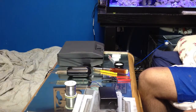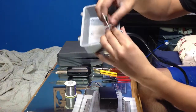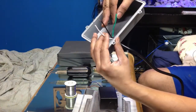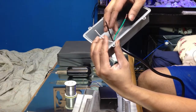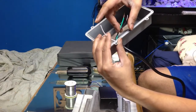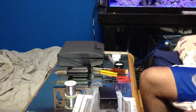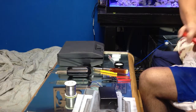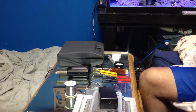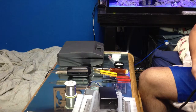When you buy a plug from Canada or the States, you've got 3 wires, but this time you have white, black, and green. So green, once again, is going to be your power ground. Your black is going to be your live. The white is going to be a neutral. So it's not that complicated. You guys can definitely do a search online to figure out exactly what wiring system or what polarity you need in your home electrical sockets. So let me show you something.